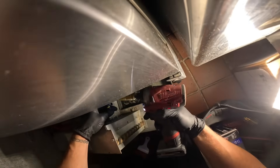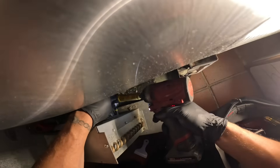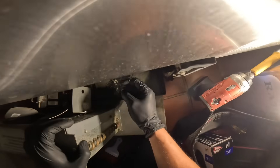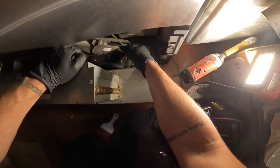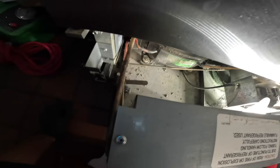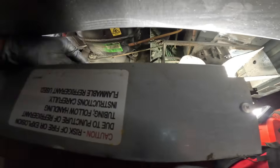Let's take that off. Let's pull out these screws. This is your condenser fan motor; this is your condenser coil. When it's blocked like this, you're gonna have high head pressure — that's gonna be the symptom. Let's get these screws out. As you can see, this motor is now free. This back side of the plate is super dirty. Now we have the coil — we're gonna push water through here out this way, because air gets pulled in this way, so you always want to go opposite of that. There's some dirt here as well, but I'm more concerned about the coil.